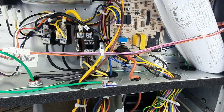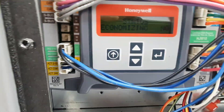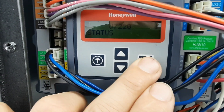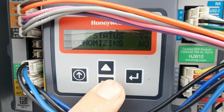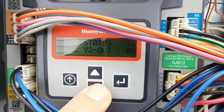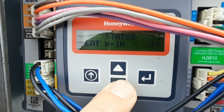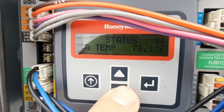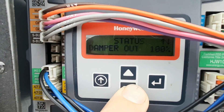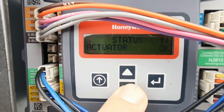Now that I've got my drill to work, everything looks normal. This says econ available: no — then why are you economizing? No econ available, not economizing. Yes, you're occupied. Y1's on, Y2 is on — which I don't have. Mixed air temp: 62. Outdoor air: 71. Outdoor air humidity: 93%. Damper out: 100%, actual position: 100% — actuator's okay.